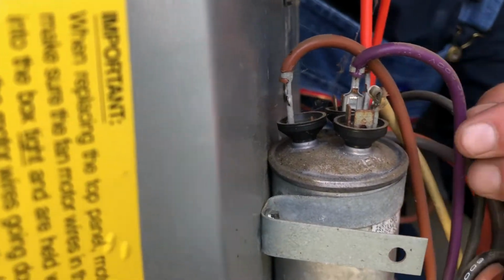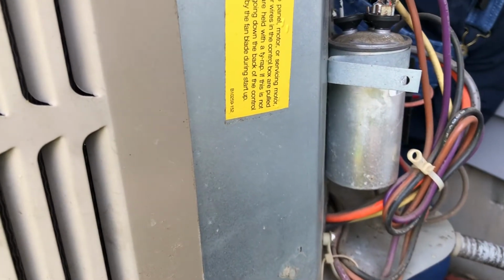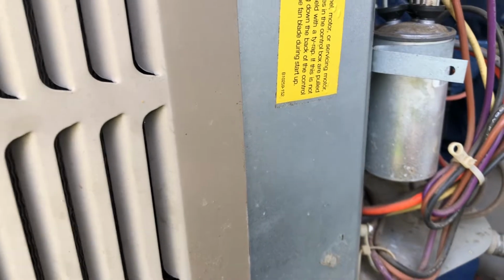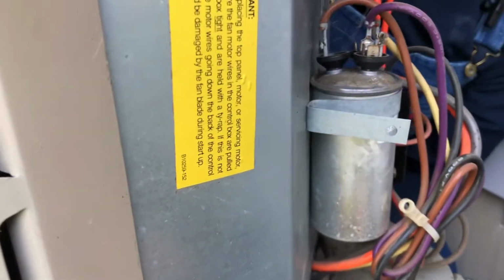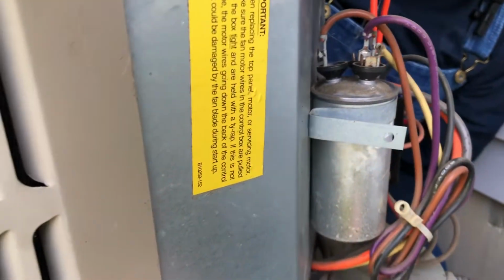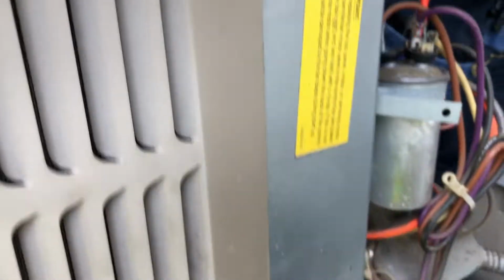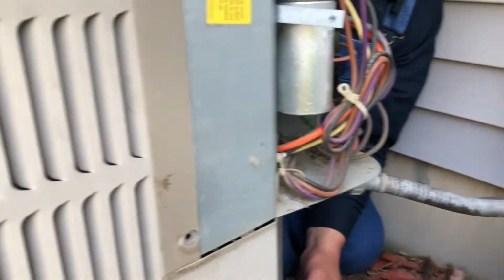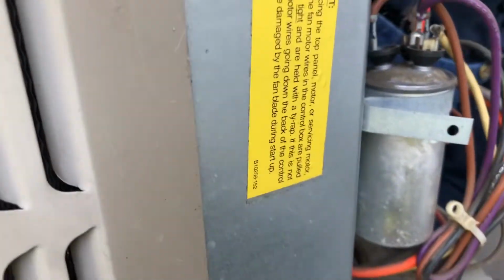Okay. So what we can do is we'll take a picture of this and remember where these wires go. And then we'll check to see if any of the farads are still present. There's two separate circuits in here: one to kick the compressor in the butt and get it going, and the other to kick the fan on. All this thing does is kick electrical components in the butt to get them moving. But if it doesn't do that, the air conditioner doesn't work.